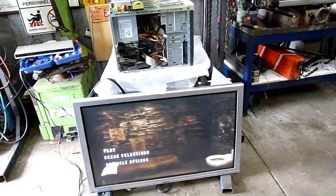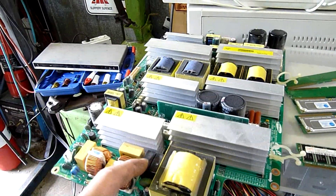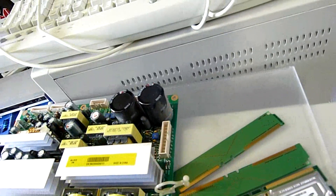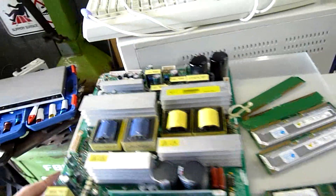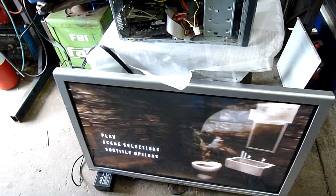One LCD and two more working plasmas. The Sony just worked anyway — it didn't need fixing. I didn't bother doing a video on the Konya one; it's a generic Samsung chassis and all I did was a board swap. I pulled the power supply out because it was only clicking once and not attempting to start — the VS and VE voltages weren't even coming up at all, not a peep. So that was just a quick board swap and it's been running on test for about six hours now. It's quite good.